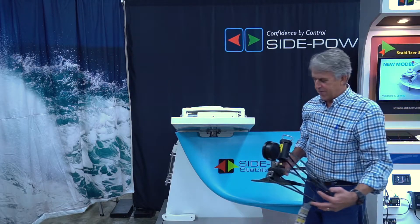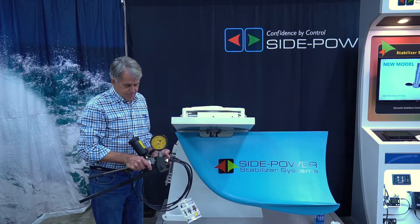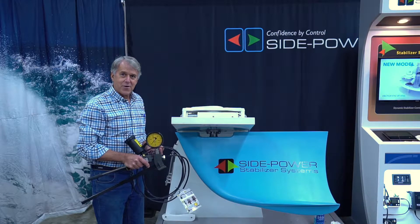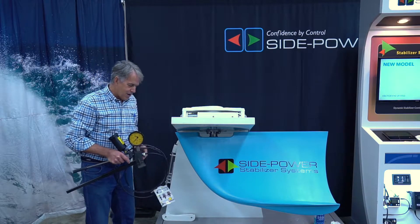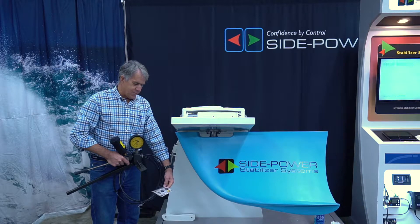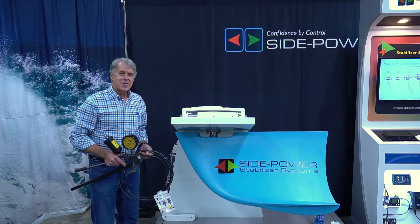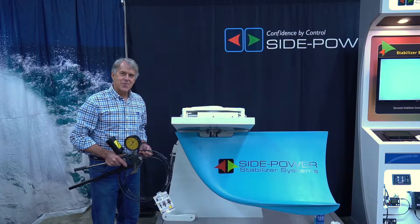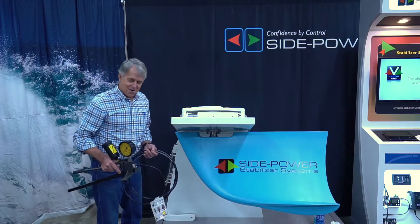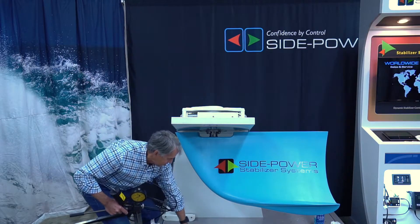There's a video showing you how to assemble this. This is the SKF brand hydraulic pump — it's a 43,000 PSI pump. Very high pressure. Treat it with respect. There are a lot of cautions about what to do and what not to do with this pump. Just bear in mind that 43,000 PSI is about 10 times the pressure used in a thruster system, about 20 times the pressure used in a windlass system. Take care — this is not a trivial piece of equipment.